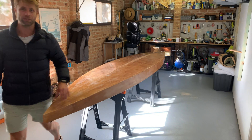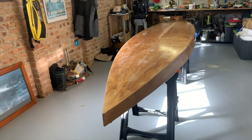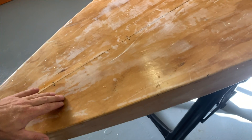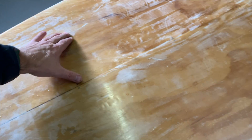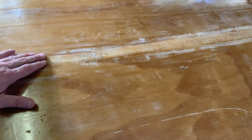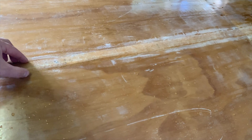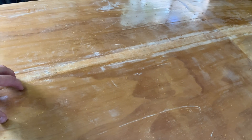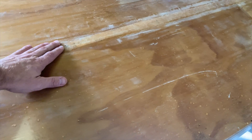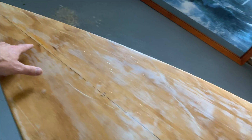Plenty of scratches in there, some big lines where I've been over some oysters. Here's the underside of the SUP — you can see plenty of scratches. This is a really good one, but it hasn't gone through the fibreglass, which is nice. If I wanted to repair that I would just use a bit of epoxy on it. You can see a thicker section here — that's where I put some reinforcement on the very bottom of the two chines that form the keel. That is polyester resin with a chop strand mat, and it is fully adhered to the epoxy fibreglass skin and going absolutely nowhere.